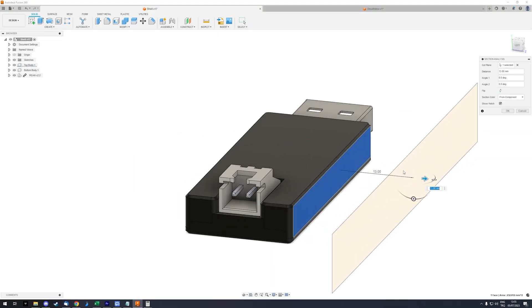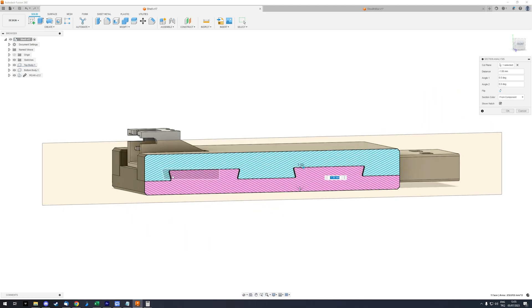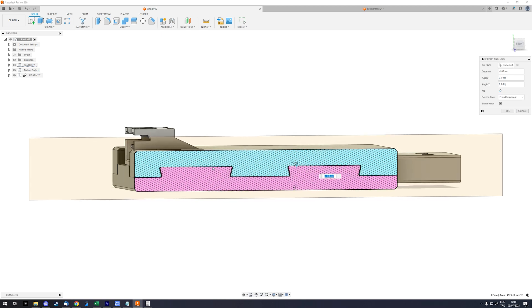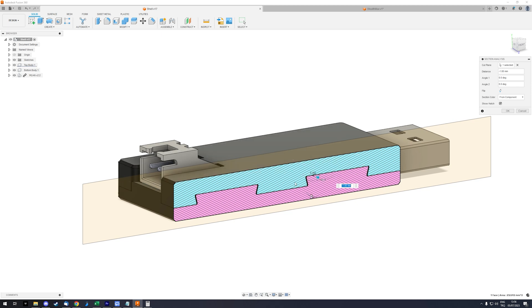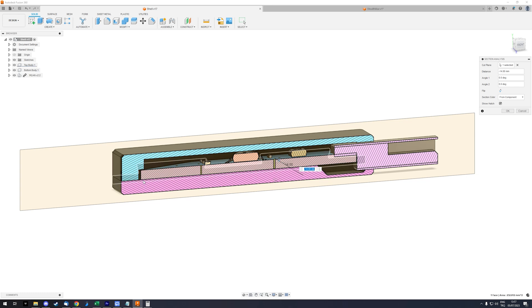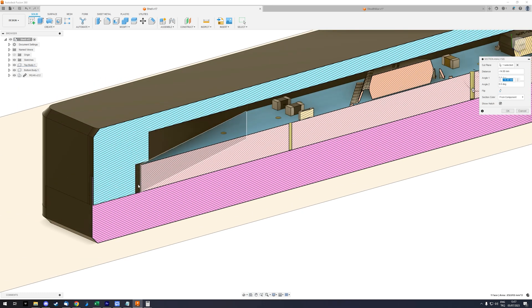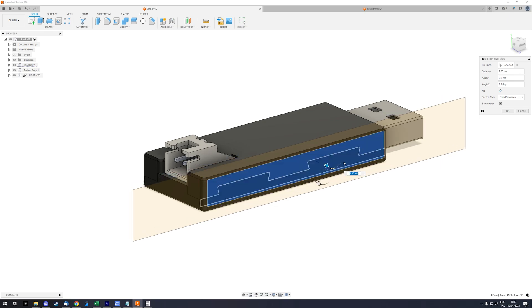You can also find the STL files for the case — the two pieces. Here in Fusion 360 you can see how the two pieces look together. There are 15-degree angle features that let it snap together. I've experimented a lot with these kinds of snap-fit designs and found that 15 degrees for ABS FDM printed parts works best. It took about 15 prototypes to get a satisfactory result. The PCB just sits in slots — no screws — and it doesn't wobble, it works pretty well.